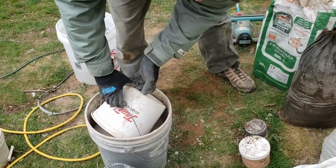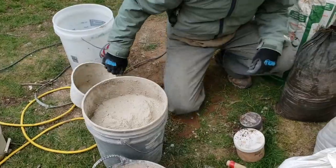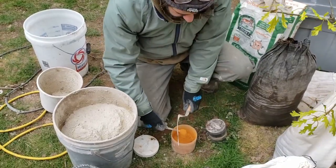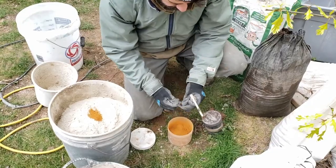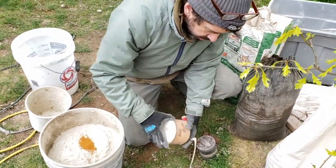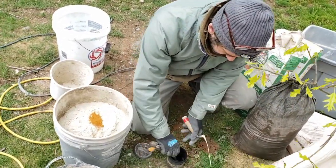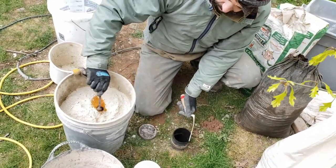Then you take slickers and you can actually push the mortar back fully into the joints. In addition to that, we are adding for every batch a teaspoon and a half of buff pigment and a black pigment, because our client wanted a mortar that was just a little bit darker than our sample. This just kind of tones it down ever so slightly. Put that in there.